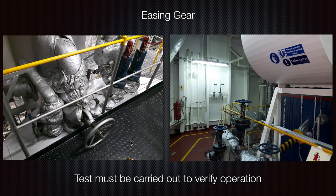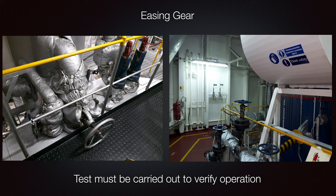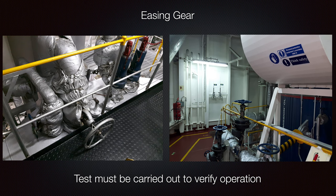In this image we can see the top of the boiler. These are our safety valves, these are the water level transmitters, and these are the scum valves for cleaning the surface. And this is the circulation boiler water circulating valves.